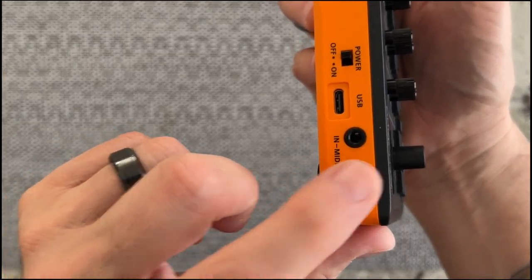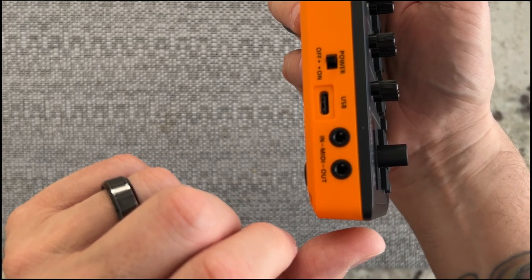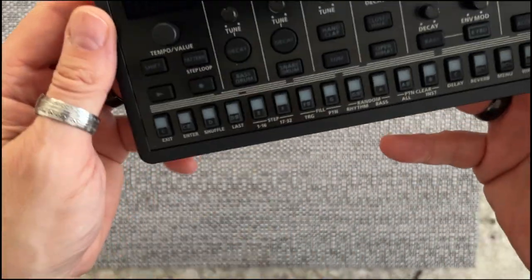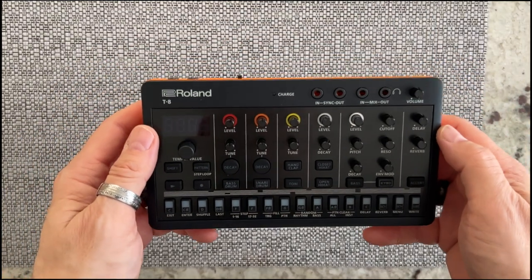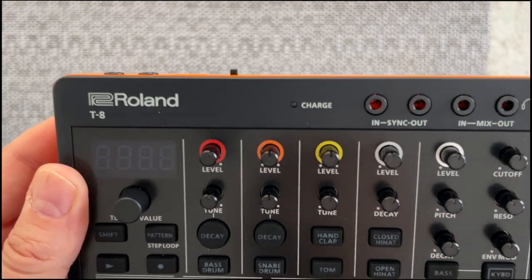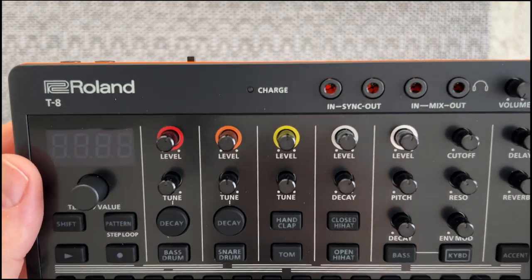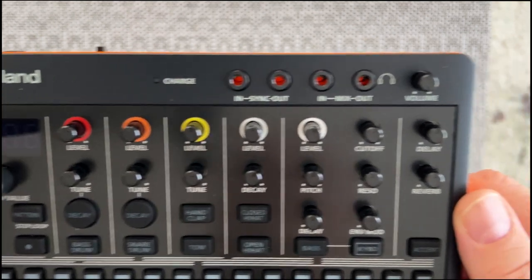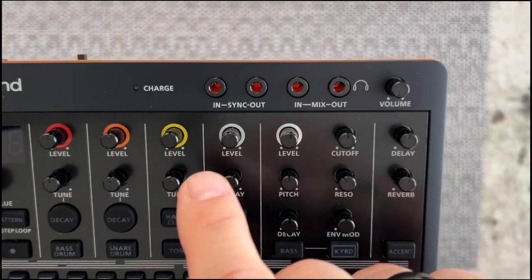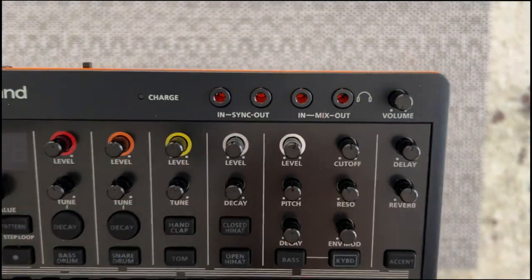Also right here, we have MIDI in and MIDI out, which are connected with a 1/8 inch to MIDI adapter. You can get those on Amazon, Sweetwater. I'll put some links in the description below. Also right up here, we have sync in and sync out, which you can hook up to Volca's, a modular system, whatever takes a 5-volt pulse, I guess. And then over here we have mix in. So if you go from the J6 into this, or this out into the J6 into the mix, it daisy chains them, which is nice.